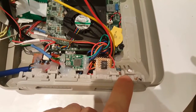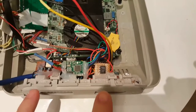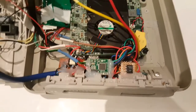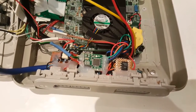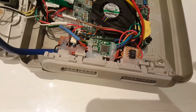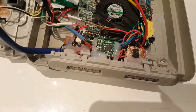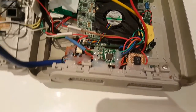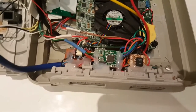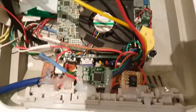The LED here is connected using two optocouplers. There's one guy on YouTube that used an optocoupler to overcome the LED problem — because the ground wasn't common between the HD LED and the power LED on motherboards. He didn't share schematics, so I thought I would share that with you guys. It was a bit of a trial and error and a learning curve, but I want to talk to you guys about that.